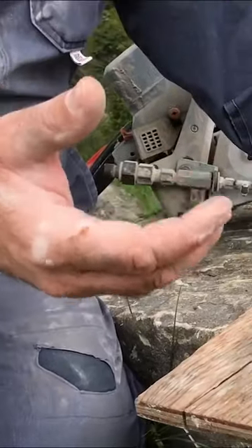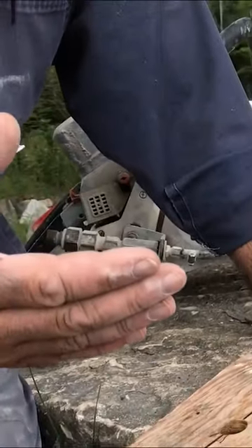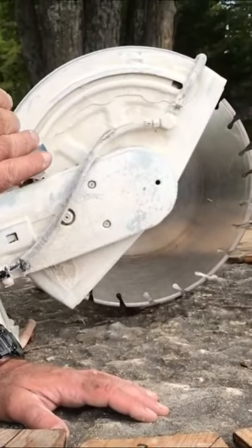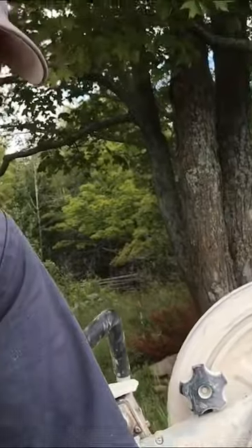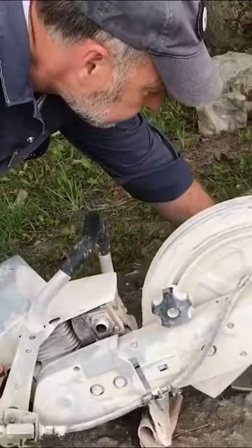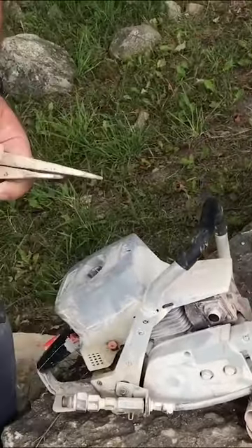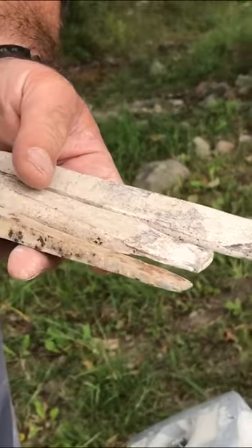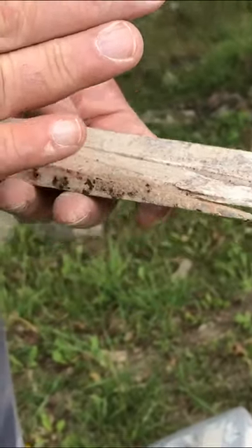This blade can't cut that deep — it just doesn't have the diameter for that. What you'll see is how I cut as deep as I can with the stone saw following the outline, and then use these wedges in the gap — in the saw kerf that I cut — and tap them in and split the stone.